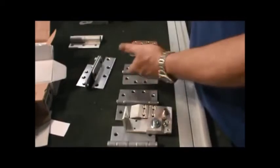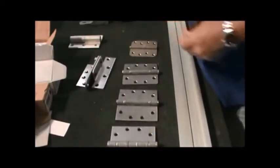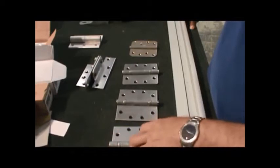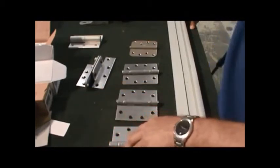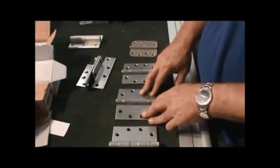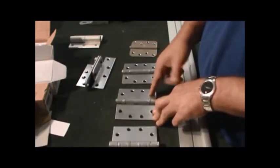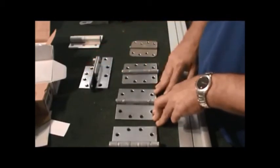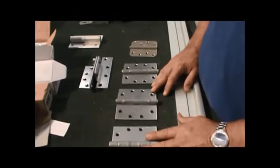It's not just like what we're doing here with hinges. You have 8 screws per hinge, and you replace 8 screws. The biggest problem you'll have on a regular hinge is you get there to do the job, and some of them will be corroded in place solid. There are 2 ways to do it. You either heat up the hinge with a torch, and beware, if you're working on a wood frame, that you may cause a fire, so don't do it in every situation. Be careful what you're doing. The other way is there are impact drivers that we use that go over the hole and you knock it out. Worst case scenario is when they snap off, you end up having to drill the hole and tap it. There are going to be videos on retrofitting that will go into more detail. These are more of an identification video.